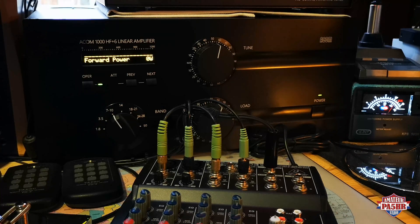Maximum output power is 1000 watts, sometimes a little bit more — almost 900 to 1000 watts output. When you have this amp and want to operate it, first you switch on the back side switch, then the front switch. When the light is green, wait almost three minutes to warm up the tube, then go into operate mode using the operate switch under the display. Switch the display to the load and plate display and tune your antenna on the amp using the cursor, then switch to outgoing power and operate mode.